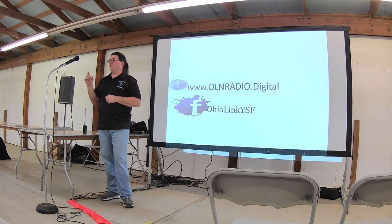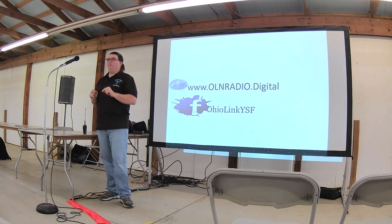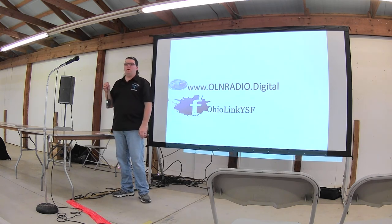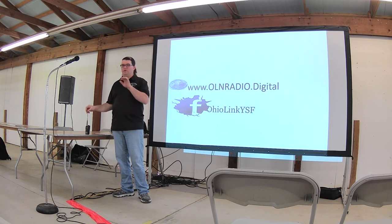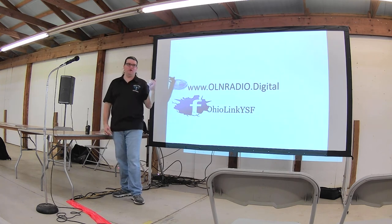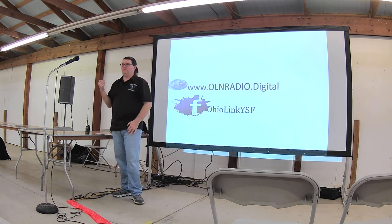If you're not in digital narrow and you go into voice wide, all the people that have personal digital nodes set up in their house or direct mode won't hear you. The reason is that voice wide, when you're speaking, is the full 25K. You're using that whole spectrum. Digital narrow splits it: voice is 12.5, your data is 12.5. And a lot of places, like the direct mode and the node modes, have to have that digital information for it to work. So you might sit there and hear a one-way conversation. You're talking, somebody's talking, and you can't hear the other guy. That's because your voice what?